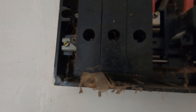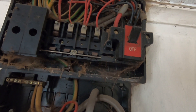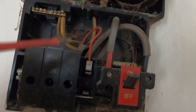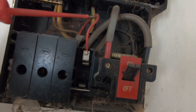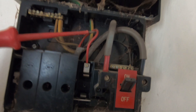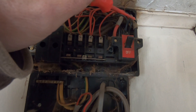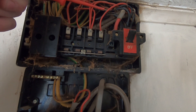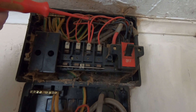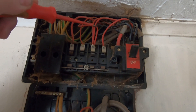As you can see it's pretty filthy, lots of cobwebs. I've taken the carriers off so you can see the circuits a bit better. This side is for the Economy 7 — this is your incoming meter tails, and there's only one circuit on here which said living room heater. Up here is the daytime units — your daytime supply, two meter tails here — and we've got four circuits. This one said immersion heater, looks like 2.5mm which is correct.